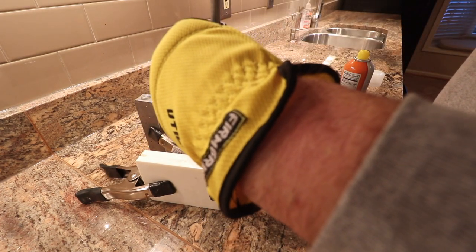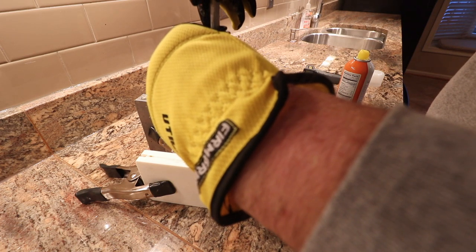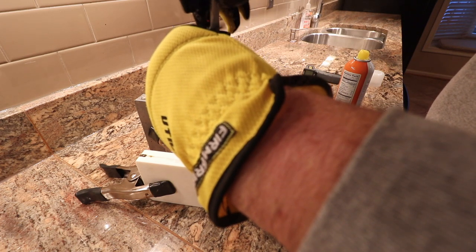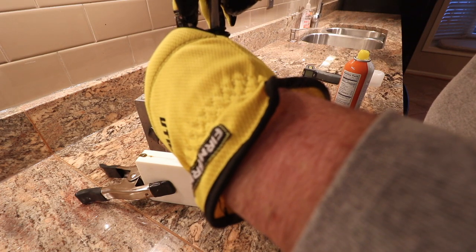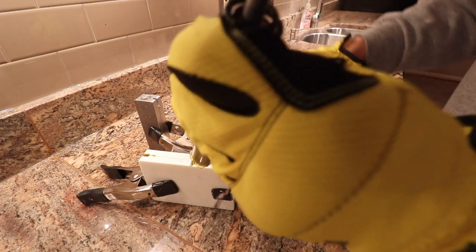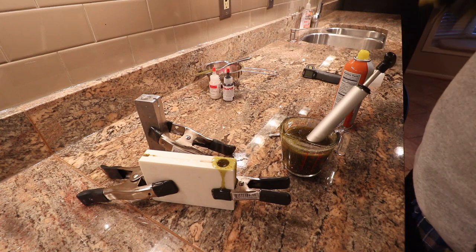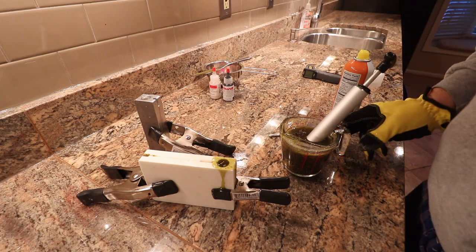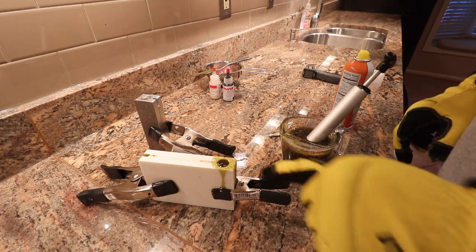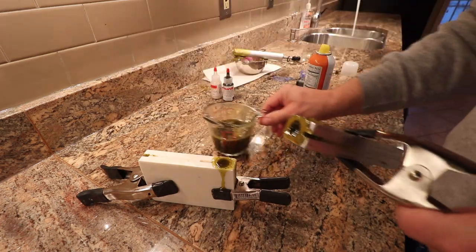All right, bring your bait over here promptly. Start the push — you'll feel the refusal, and I go nice and slow and easy. When I get to refusal I just push a little bit more, push a little bit more, and then I squeeze a little into the top of the sprue right here. Heat that tip up a little more — that sprue might need a little more. See how it's sinking in? That's how it works.